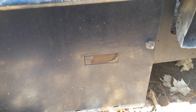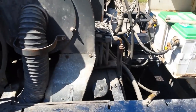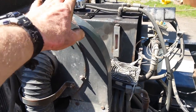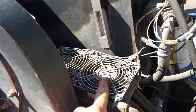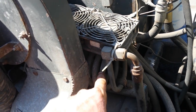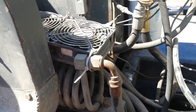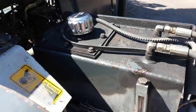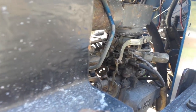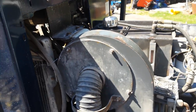Here's access again to the broom on this side — you've got to unbolt it to change it and it slides right out. There's the vacuum that sucks things up. This is the cooling — I mounted a little fan here myself. There are two computer fans that run on 12 volts; they cool the hydraulic oil. I think that's the return line to the tank. There's a filter back here, and there's the tank — it's probably about a three or four gallon tank.